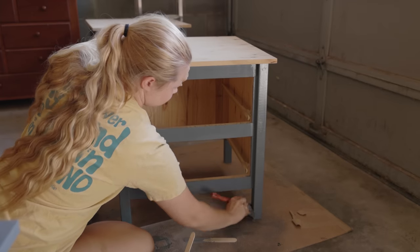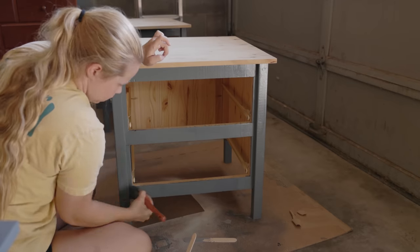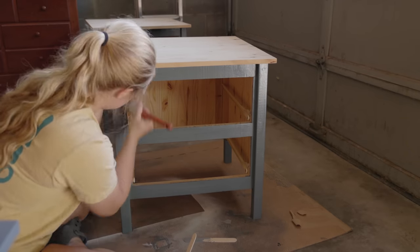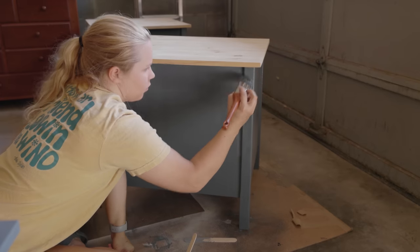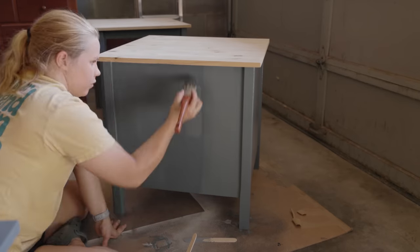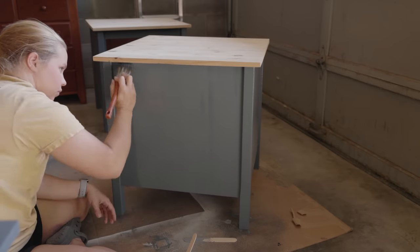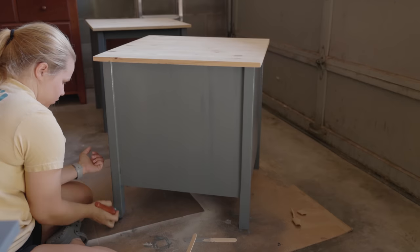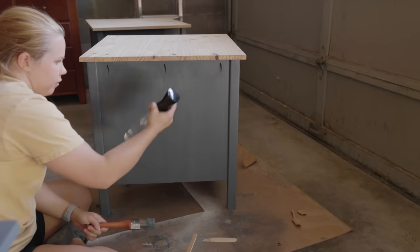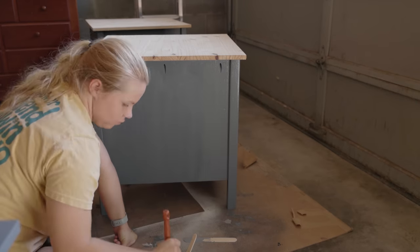I would highly recommend to try not to paint in the direct sunlight because that is going to affect the paint and how quickly it dries. If it dries too quick, even self-leveling paints are not going to have enough time to self-level. So super important that you're at least not in the direct sunlight. Try to maybe even paint when it is not as hot in the day, like maybe paint in the mornings and in the evenings when it kind of cools down.